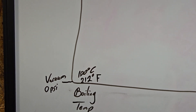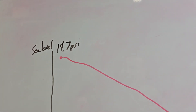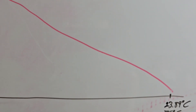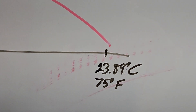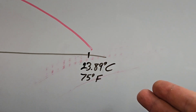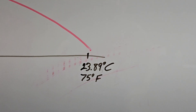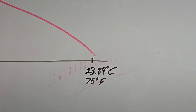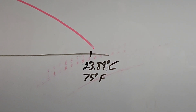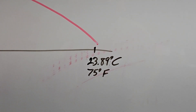Here's the thing — the bar down at the bottom of this graph is a total vacuum. As the pressure gets closer to a total vacuum, water boils at a lower and lower temperature. Notice it doesn't go all the way to a perfect vacuum because it's physically almost impossible to achieve one. But when you get down to about 29 inches of mercury, which is a pretty low vacuum, water is going to boil at 75 degrees Fahrenheit, which is 23.89 degrees Celsius.